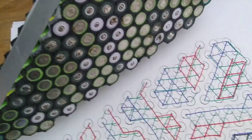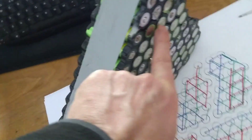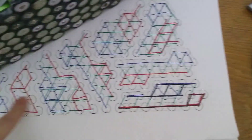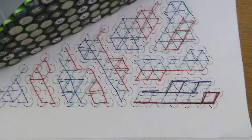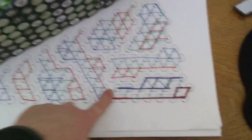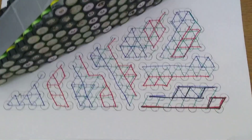That's the easy side done — now comes the hard bit, the other side, because that's where it can bite. At the minute, because these cells are linked, there's around seven volts between certain points. You can see my diagram there showing how I did it. You really have to draw these things out — if you don't, you're going to have major problems. This was about the fourth or fifth attempt to get the parallel and serial links as good as possible.